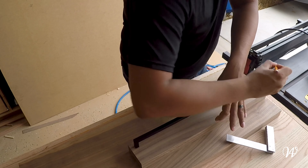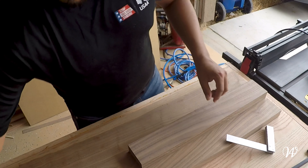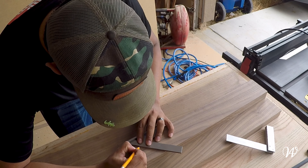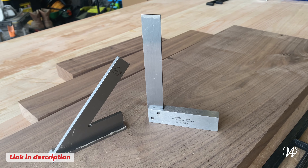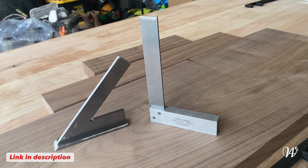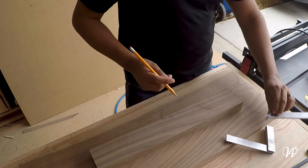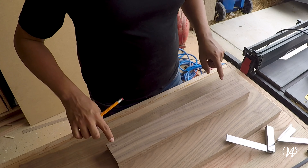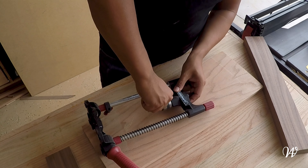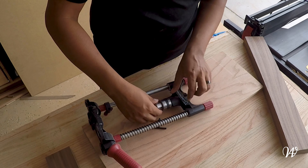Now the square I had been using previously was slightly off, and I would notice it when I was making bigger cuts. So I went online and picked up some of these engineering squares. They are probably about a fraction of the price of anything you're going to find from Rockler or any of the big brands like that, and they are dead square. I've already been able to see such a difference in my build — I've done a few test cuts and calibrated my tools and I'm very happy with the way they're working out.